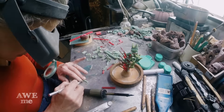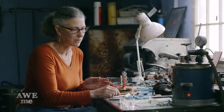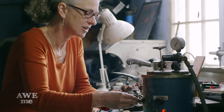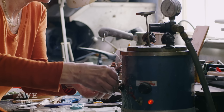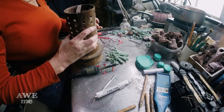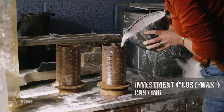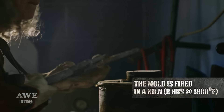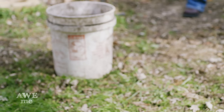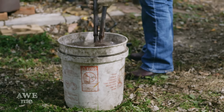We've deconstructed one of the bows so that we could get all the parts and mold them. We used a two-part dental mold that I can then do the wax injecting into. After making the waxes for the buckles and the crossbow sections, Lauren sets them on a tree and invests them so that we can do the casting. After the metal temperatures fall below 900 degrees, we quench it into water and it reveals all the pieces.